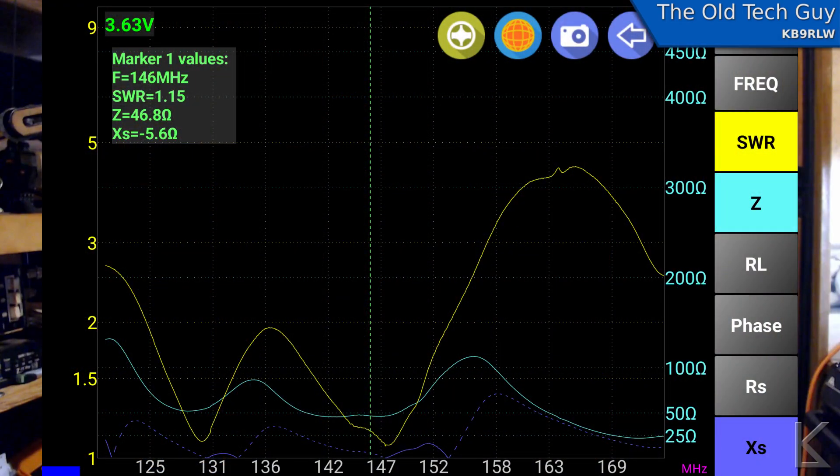The other claim is that it can do VHF and UHF. I swept it with the VNA on two meters after adjusting it, and by golly it had a dip right there on two meters that looks totally usable. I was wondering how one loop could do both HF and VHF. Then I realized the knob settings were very similar to where they were for 20 meters. There's a harmonic relationship: 14.652 MHz times 10 is 146.52 MHz. So I think it's working on a harmonic — but it does seem to work.